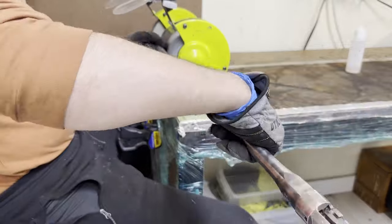Now it's time to apply our wood stripper. Wood stripper is used to remove the old stain and oils from wood. Degreasing and rinsing with water makes the wood stripper's job easier — it's not having to work as hard to get through the grease and grime, and also seems to open up the pores in the grain, allowing the wood stripper to penetrate deeper. I apply a pretty heavy coat and let it sit for about 15 minutes. I wipe off the excess with a paper towel and use a paint scraper to remove the rest — be careful not to scratch the stock. Be sure to use chemical resistant gloves, as this stuff will burn your skin. I also wear eye protection. Once done, I degrease again with the crud cutter, soap, Goof Off, and steel wool, then rinse with water.